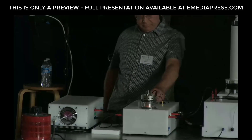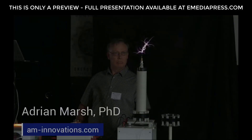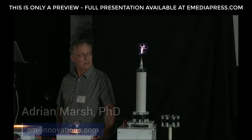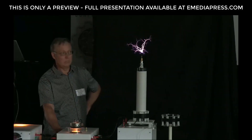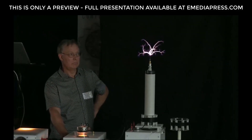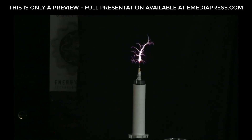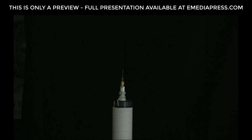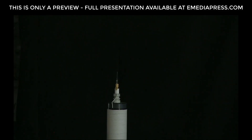The glow has started here. What's the temperature of the top of the barrel? A lot. If it starts to go green there, you basically start to vaporize the copper — that's too much. So I tend to keep it below that.